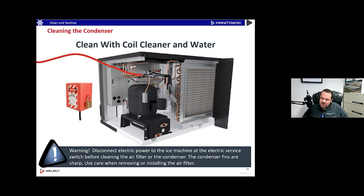If the condenser is dusty, use a pressurized line to blow it out — nitrogen, CO2, or compressed air. Don't blow it out with any kind of refrigerant. Blow it from the inside out to reverse the normal airflow direction, since this machine sucks air in the back and blows it out the sides. Reversing direction helps clear out that condenser.